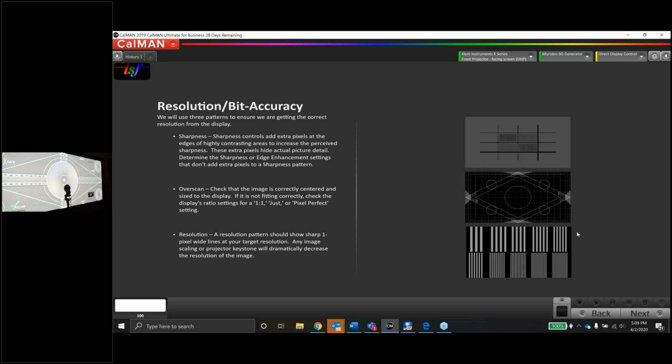And looking at it from here, even if I look really close, the sharpness is already at the correct position for this picture mode because I don't see any distortion. And also at the same time, those lines don't look out of focus or too soft or too fuzzy. So for color and tint and for sharpness, I'm going to leave those at the factory default settings. Those seem to be pretty good.